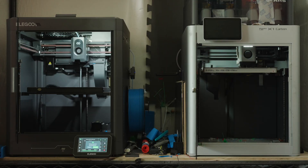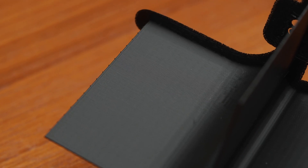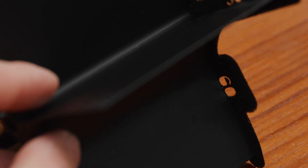I have my printers on a wire shelf rack with three-quarter inch plywood and some foam underneath that helps dampen vibration, but I've never had issues with vibrations with this setup. Taking a closer look at the VFA tests, they're extremely clean. For default settings and very minor adjustments, I was really happy with what I was getting, and it made me feel comfortable doing the rest of these tests on both machines at the same time. One mistake I made was leaving brims on by default or in auto, as it sometimes applied brims to prints I wouldn't normally use brims for.